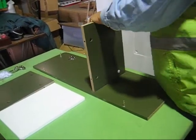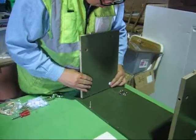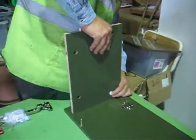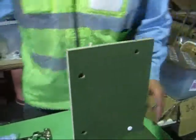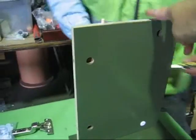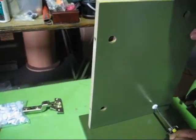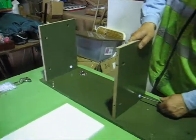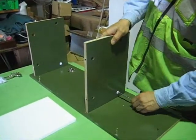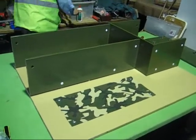Wooden dowels 60% in, 40% out. Now put the lower piece in position and put in the locking device — the white button — like that. Now put in the top piece as well. Bear in mind at this stage the tool hole must be on this side on top, then lock it in.